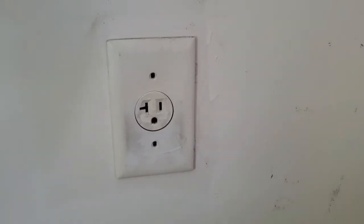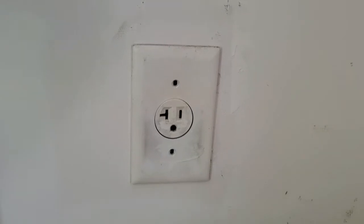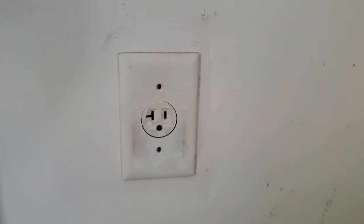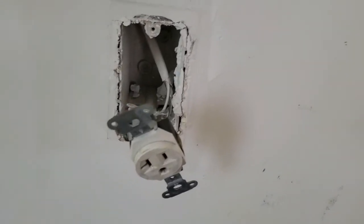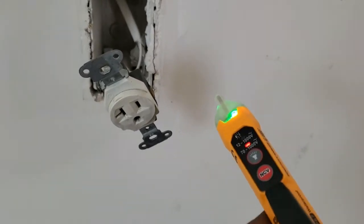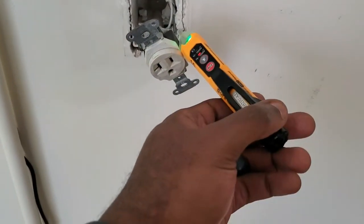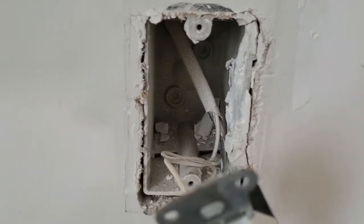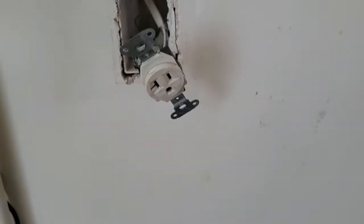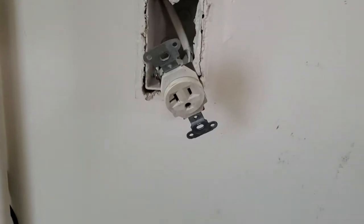So with that said, let's go ahead and show you this project. Happy DIY Thursday. We're gonna change up the single plug to a two-plug socket and then run conduit down and turn that into another set of sockets. We have the socket opened up. The first thing we want to do is turn off the breakers, and you always want to carefully test to make sure nothing is live on this circuit. We see nothing is live, and there's the 14 gauge wire in our household. We're going to replace everything with 14 gauge wire.